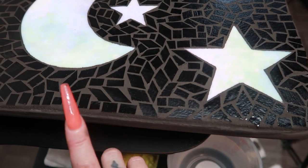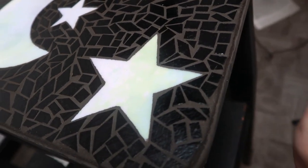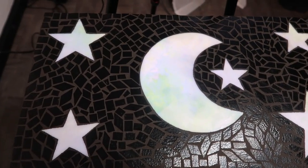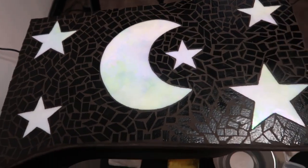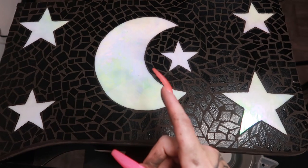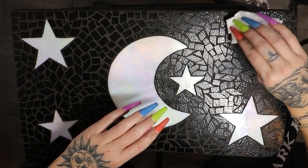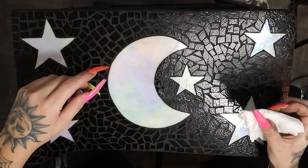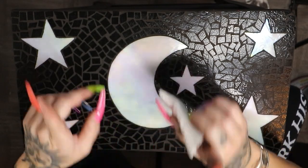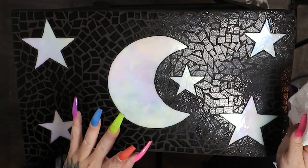Oh my god, this is so much fun — holy smokes, I want to do five more mosaics! This took eight hours just to lay this black tile — imagine if we did a more intricate pattern. A lightly damp sponge seems to work okay too, but try to avoid putting more moisture into the grout than it needs — stay as dry as you can. Look at that — we did it! I'm happy with how the edges look too — we've got a nice edge of grout with no tiles sticking through, exactly what you want, smooth. We still need to give it a fresh coat of black paint, replace the chair pad, and seal this grout once it's completely dry.